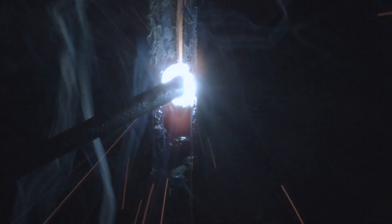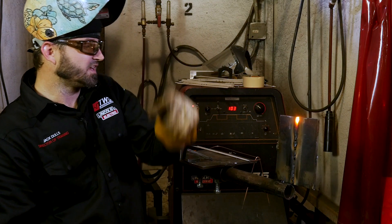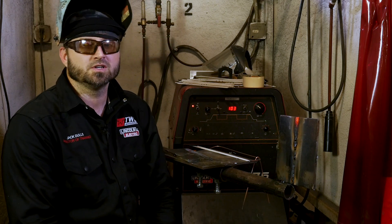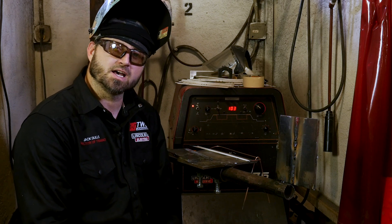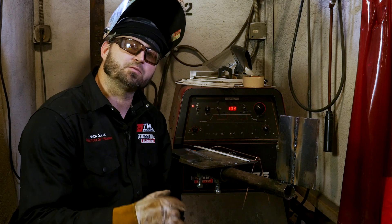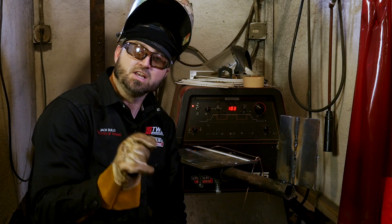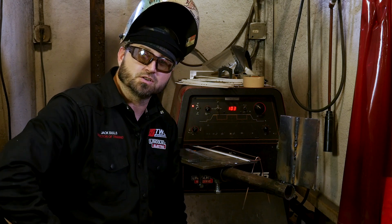I'm going to start the long arc — now you can see it. Now it's starting to make a hole. You can see how it's really just ripping open. I'm having to really step it because it's starting to rip open. And that's where you have too much heat — you're long arcing in there, it's ripping open a big keyhole, and that's not what you want. So keep a nice tight arc length the whole time. Keep it in there, nice and consistent, nice smooth steps. Watch your keyhole, make sure you're reading that puddle. If the puddle's small and keyhole's small, stay close to it. If the puddle's starting to grow and the keyhole's getting bigger, you're going to have to start moving, getting farther away from it — that's where you can control it.